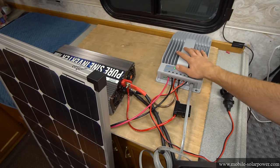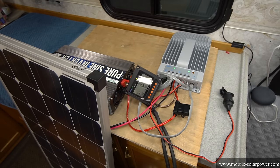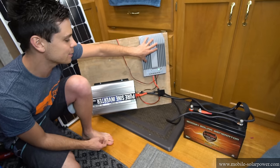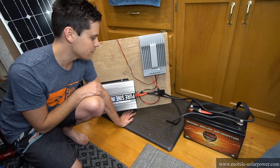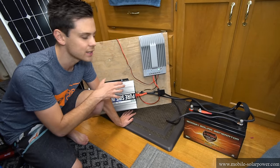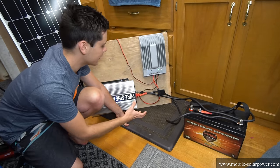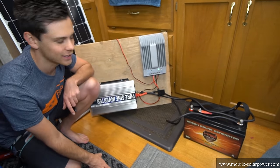You can mount this board with the components in a closet and put the MT50 screen somewhere in your living area, and put the battery somewhere safe. That's pretty much it — this is super easy to build and anybody can do this. You can find all of these parts at local stores and on Amazon. Even though this is very easy to build, I definitely recommend learning how to crimp and measure and cut wires properly to build custom systems, because then you can make any size system you want. In this system we're constrained to the length of wire available, but when you can crimp wires you can build anything you want.